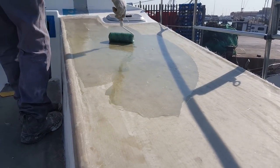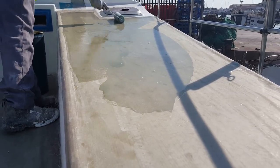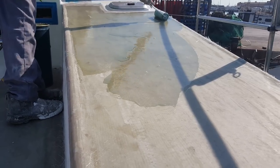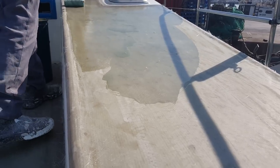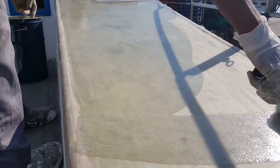That's the lip you can see — we're going to do the build-up and get back up to level. The reason we do this is because you can't build up polyester to like 10 layers at a time, so we do three or four layers at a time. This is the last one, and in total it'll be eight layers thick.